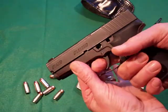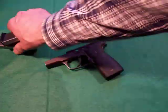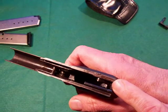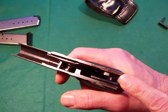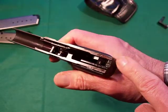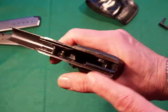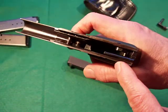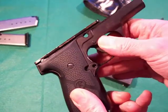Once the disassembly latch comes out, pull the trigger in a safe direction and the slide will come right off. Here's the slide — there's the inside. When you pull the trigger you can see the camming action. That's the cam that retracts the partially cocked striker. Pulling the trigger completely cocks it and then releases it — that's why it's called double action. Unlike a Springfield XD which is fully cocked, this is like a Glock where it's partially cocked and you pull it to complete the cycle. You can see there are a lot of slide rails on here, hence the smoothness — it's really finely machined.